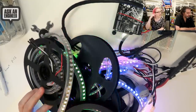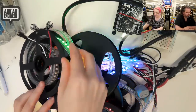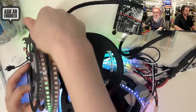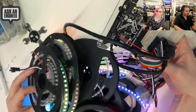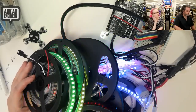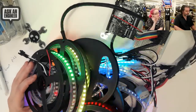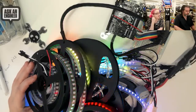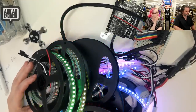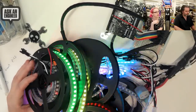To use that library, we recommend the Friend as an accessory. I can easily plug in and unplug a ton of NeoPixel strips — I've got like eight strips here in a big pile. You can use it with any SAMD board — the M0 or SAMD51. Not every pin can drive the NeoPixels because not all are on that peripheral, but all our boards have at least eight pins you can use, except the Trinket and Gemma. On the Metro M0 it's pins 0 through 7, and on the Metro M4 it's pins 2 through 7 and then 10 and 11. If you want to add a ton of NeoPixels to your project, this little accessory plus our library is really inexpensive. It can drive a couple thousand LEDs quite easily, and you get tons of processor time left to design how you want your lights to look.